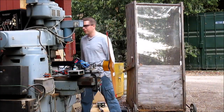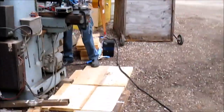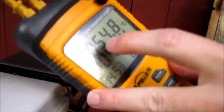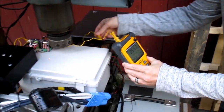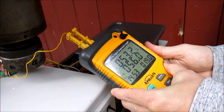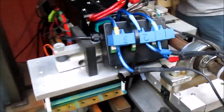Might be able to improve the thermal heat sinking. Perhaps. Where are my temperatures at? 55 degrees — MOSFET temp on the case, 55 degrees ambient in the case. MOSFET leg temperature — there's a delta between the MOSFET case and the MOSFET leg of only 3 degrees C warmer.